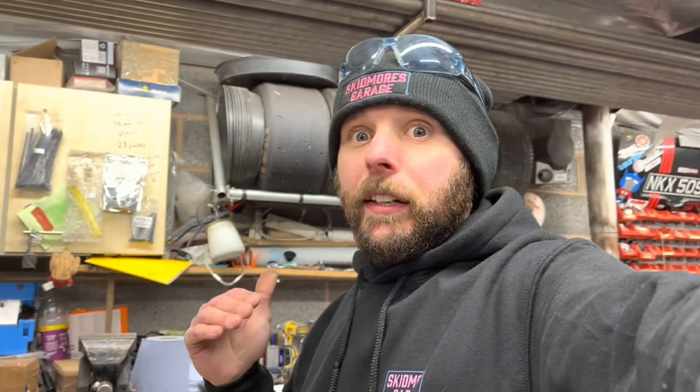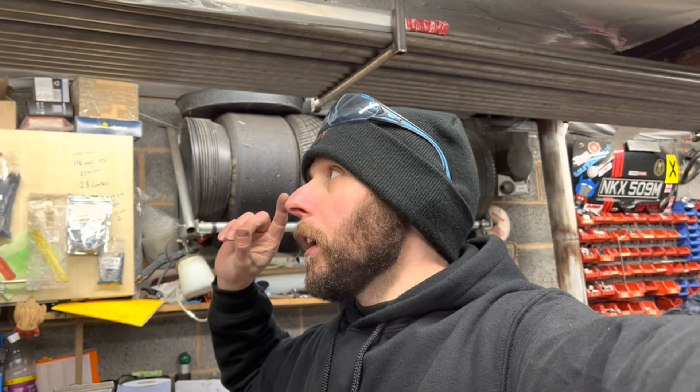What we're going to talk through today is bending tube. We've got some 45 mil tube and we've got to clean it because all this tube comes in covered in oil. What I do is use brake cleaner or carb cleaner - same stuff. Clean it down with a rag, then clean it again, then scotch bright the whole tube, then clean it again with acetone. You want it nice and clean.